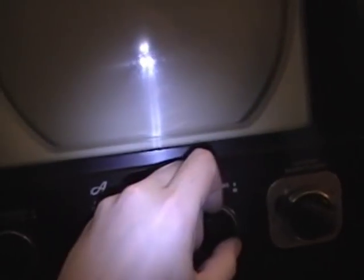I've got a Blonder Tongue modulator set up going to my DVD player with some nice vintage black-and-white footage and my set here. What I want to do is power this up with the old 10 BP4 tube in it, and then I'm going to pop in this new 10 FP4. By the way, I have tested this tube and it tests out better than any tube I've ever checked before, so this is indeed an unused tube, or at least it's seen very little use.